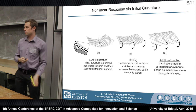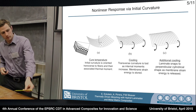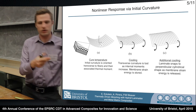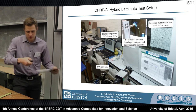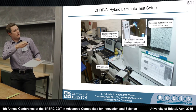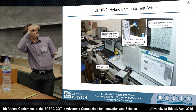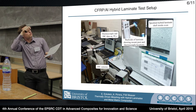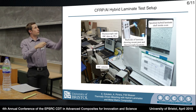We've all experienced this on an everyday basis, and now we're putting it to good work. We've done an experiment making a carbon-aluminum plate with initial curvature, just like the tape measure. I've placed it in an oven with little spots on it so I can track displacements with 3D digital image correlation using cameras, and we can also measure temperature using thermocouples.